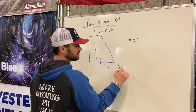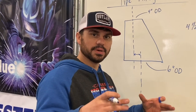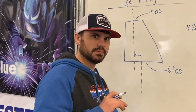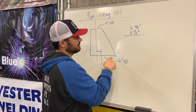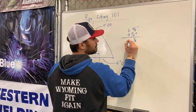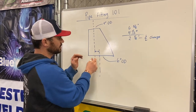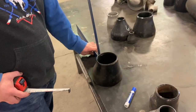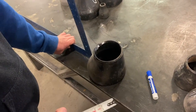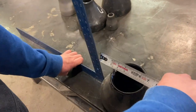The OD of the six-inch side — outside diameter — is six and five-eighths. Keep in mind: the outside diameter of the pipe must be bigger than the inside diameter, otherwise the pipe would be inside out. So we subtract the four-inch OD from the six-inch OD: six and five-eighths minus four and a half gives you two and an eighth inches of center line change on a six-by-four eccentric reducer. Another way to do this without the math is to set up a square on your fab table — your fab table has to be flat and square — put the square up against the pipe and just measure the difference. That's two and an eighth, exactly the same as what we came up with on the board.